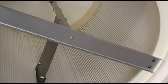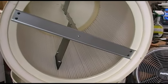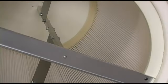The shape of this cone and the chamber surrounding it forces the heavier particles like the chips to go downwards. The very small and very light dust particles can stay in suspension in the air and travel up into the filter element. The inside of the filter elements depend on a layer of fine dust particles to help filter out smaller and smaller pieces. But when the larger chips get up there they just block air and reduce efficiency — that's why we use the vortex to get the heavier chips to go downwards.